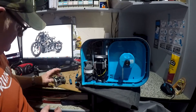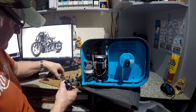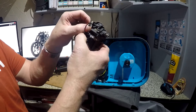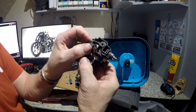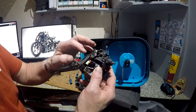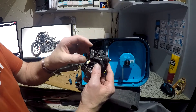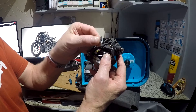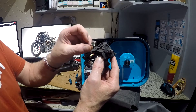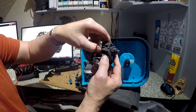Right, I'll show you what I've done. That is your top cap of your extruder. You can see it there - there are screws to take out there, there, there, there, and there. I always take the black screw out as well, which holds a sensor to tell you that your filament's run out. So now when I take this off you'll see what the problem is.